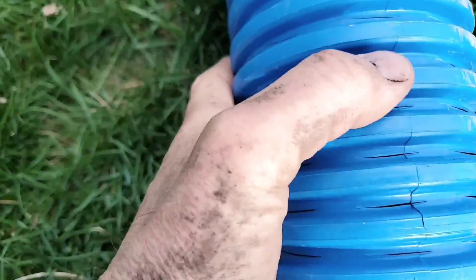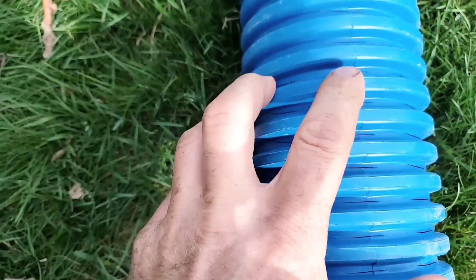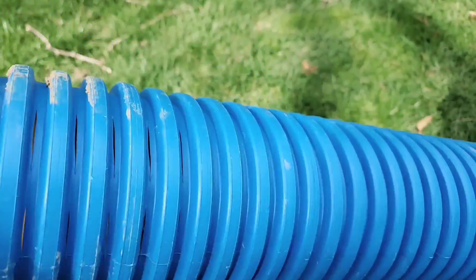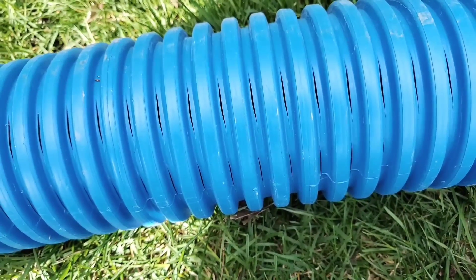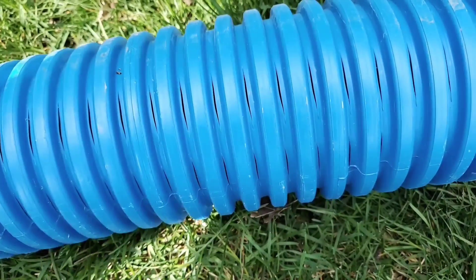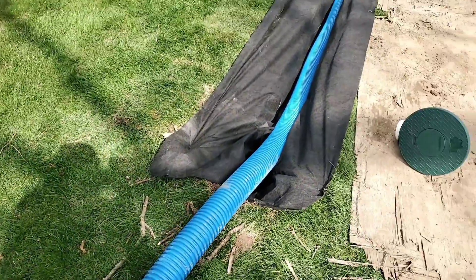This is knife cut. You can see how there's no material removed — there's just a slice made. That's what knife cut is: you take a solid pipe and just take a blade. In manufacturing, a blade cuts what's referred to as knife cut. This is a form of drain pipe that falls in the category of perforations because it will take in water, but the knife cut doesn't remove material. Perforated pipe from big box stores has the material ground out. Knife cut loads with water and then has a slower release — it slowly releases the water. That's how we use it when building leech lines and leech fields.